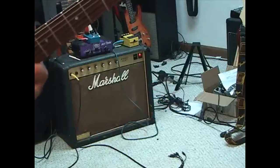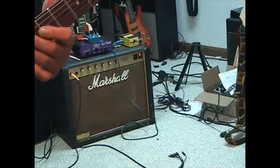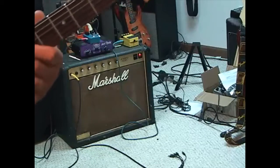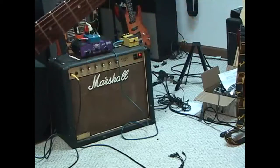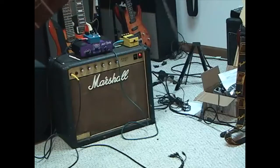Now, classic old vintage Marshalls, generally, I know a lot of people, for collector's items, don't want them touched. But this was my own personal thing, and I didn't want to change it into another amp. I just wanted to tweak a couple of things. Basically, put a post-phase inverter master volume on it, so you could do a couple of things on it that you can't.